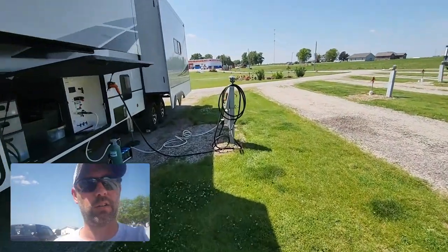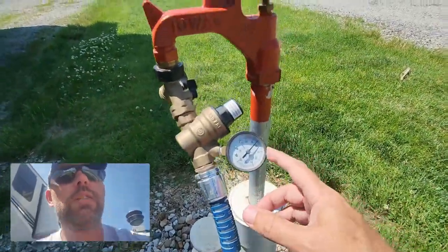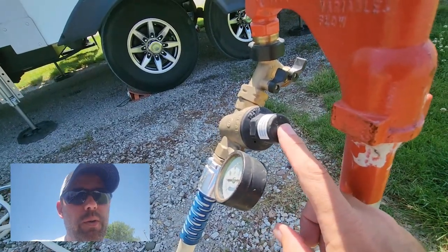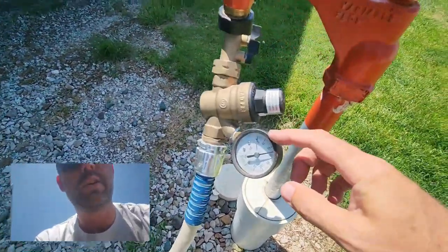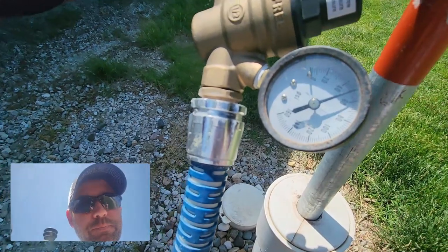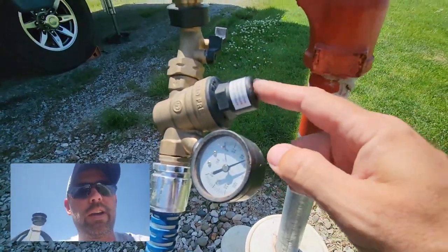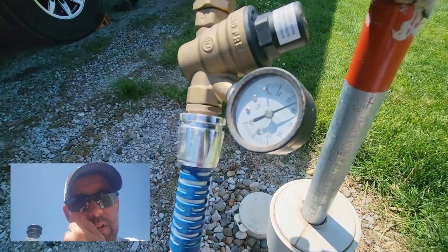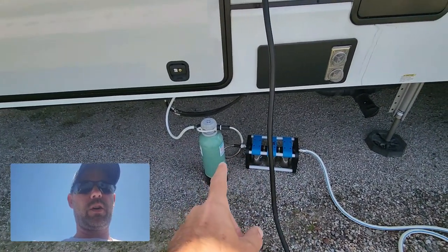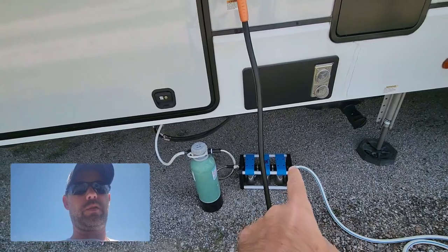One little tip we do when we get set up: we have the water pressure regulator valve, and I take a flathead screwdriver and turn it down to the lowest setting possible so almost no water will flow through it. Then I turn the handle on, and it'll come up to as high as it'll let it — usually about 40 psi — and then I'll turn the screwdriver up until I get my pressure to about 50. That way I know I have good water pressure, and if it's already too high and I just blast it in, it'll blow a bunch of pressure into my system. Start lowest and work your way up. We have the Blue Technology water filtration system and the on-the-go water softener — make sure the water goes through the filter first before the softener, because you don't want to put softened water through those filters.